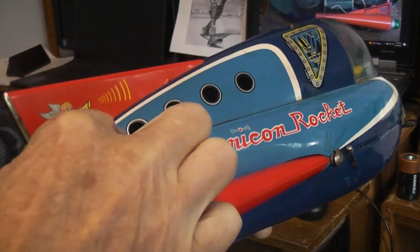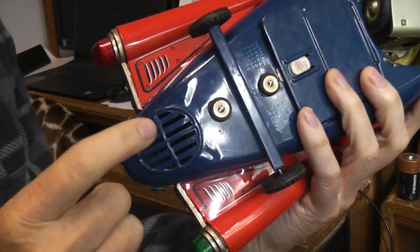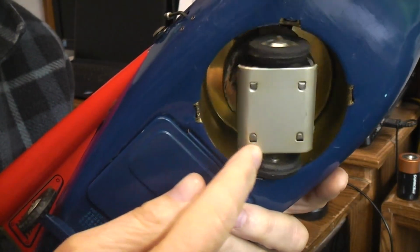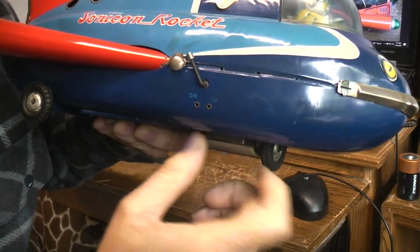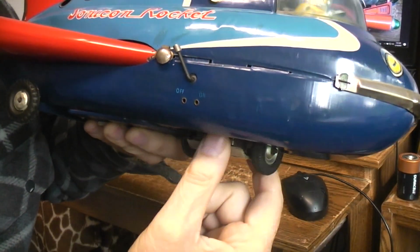Sound can get in through these holes and through the main vents, which go to the Helmholtz resonator in the bottom. You've got a motor-driven drive, which has a ratchet. When the toy is sitting like this, that locks. It won't turn this way, but I can turn it this way, and you can actually hear the ratchet lock.